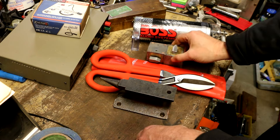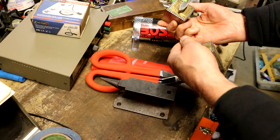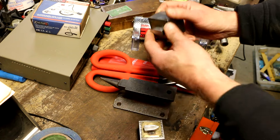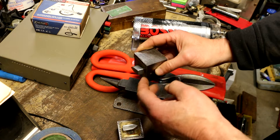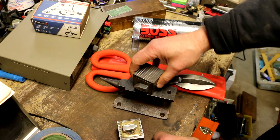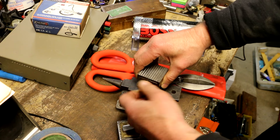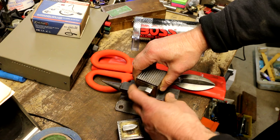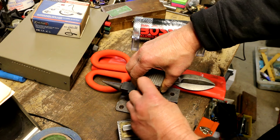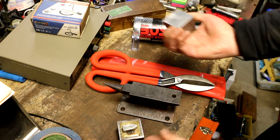These items here I also don't remember what I ended up paying for, unfortunately — but I'm sure I got a pretty good deal. These are some unusual little magnetic transfer blocks. They work just like regular magnetic transfer blocks that you would use on a magnetic chuck on your surface grinder. But you can actually flip this lever — so that's completely off, and then that's on.